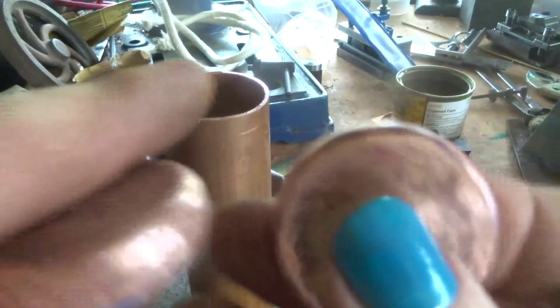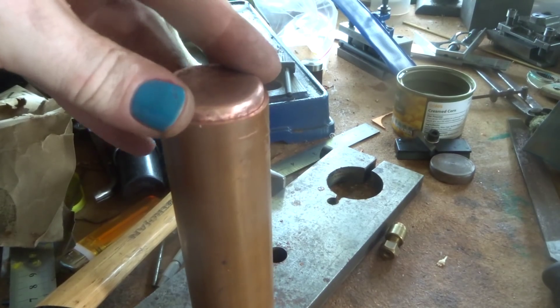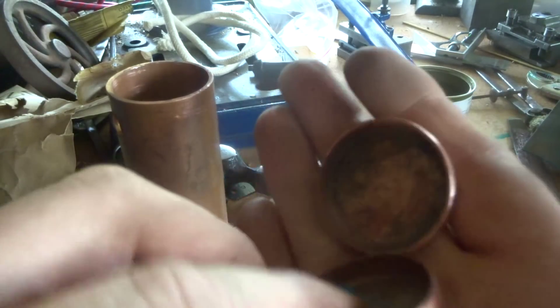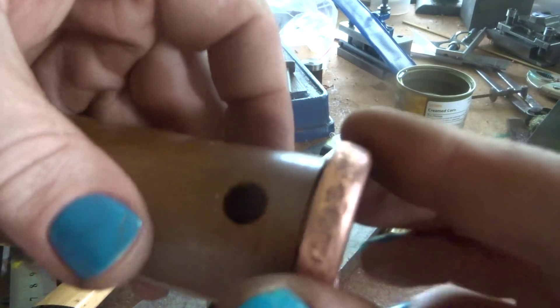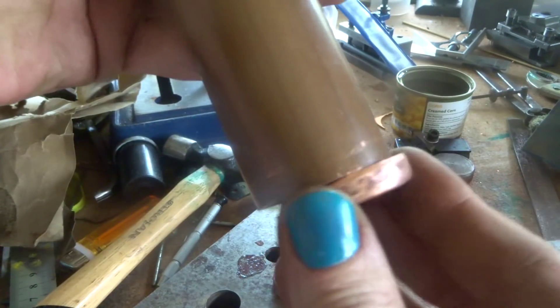So after all that we've got two nice little boiler ends. They're going to be a nice tap fit in there — that one and that one in both ends. So there's still one more job to do on these: one of them needs a hole drilled through from the inside for the pipe, and that lines up with the top of the boiler. And that's the steam pipe to the engine, on this end I think. So that's the next job.